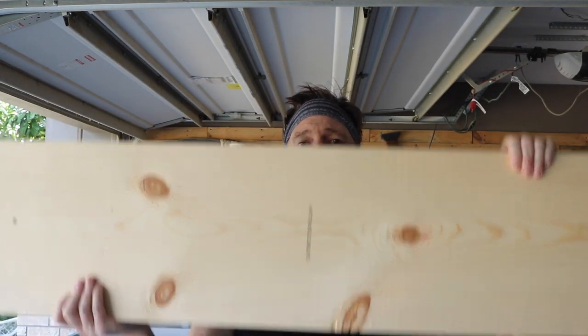It's going to be a pretty straightforward build. There's a million videos out there on how to build cornhole boards, so I'll link to a playlist of videos I watched to learn how to build mine. The dimensions are straightforward - a two foot by four foot surface for the boards. I bought pre-cut two by four foot pieces of plywood. For the sides, we're going to use one by fours, which we'll rip out of a one by twelve because they were cheaper at the big box store.